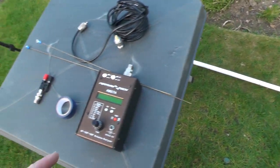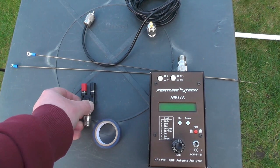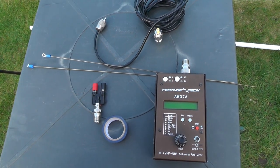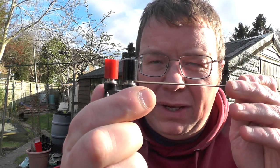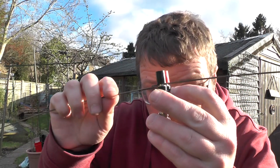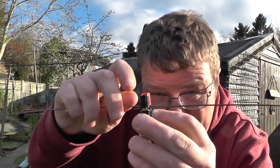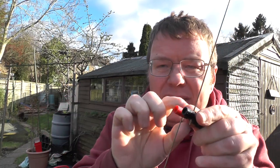All we're going to do is poke a piece of wire through the adapter and tie the connection down. To build the dipole, we unscrew the black and red terminals, poke a piece of wire through the black terminal — which we've done there — and then screw it down. We do the same with the red terminal: the wire goes in, then we screw it down. And there we go — that's basically our dipole built. Let me go and mount this onto the pole.